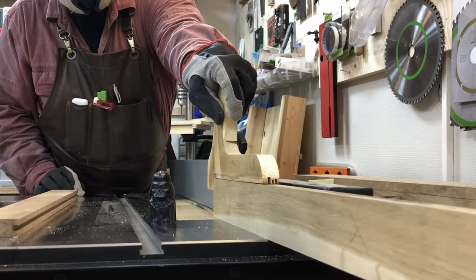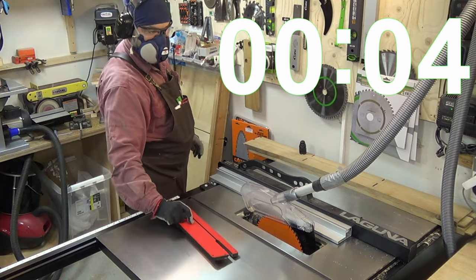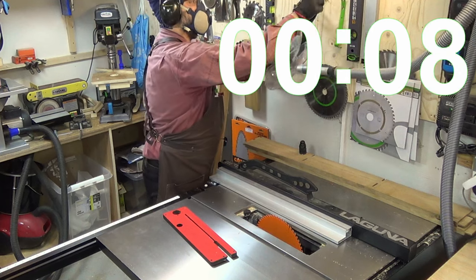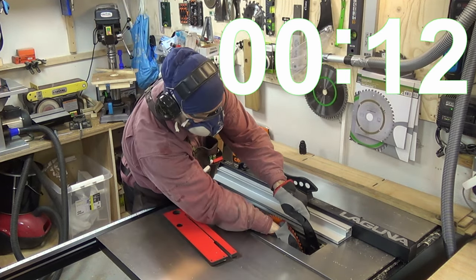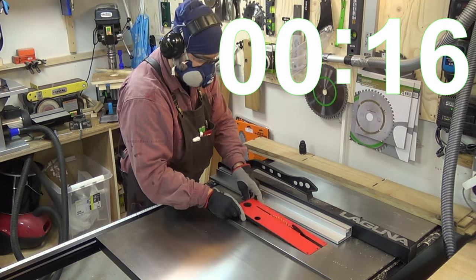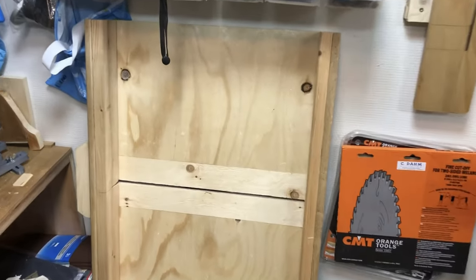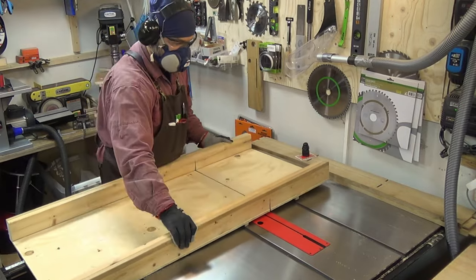In my humble but honest opinion, the most important safety feature on a table or cabinet saw is a quick change riving knife. This is because it makes a change between riving knife and blade guard a breeze. This is a real time swap. And the saws that I know come with this feature are the Laguna Fusion F3 and the European version of the DeWALT DWE7485. If you know more saws that have this fantastic feature, please pitch it in the comments below.